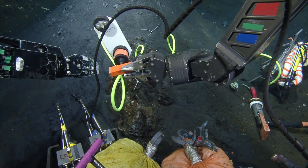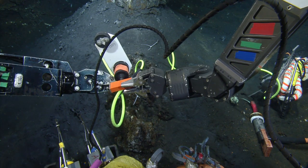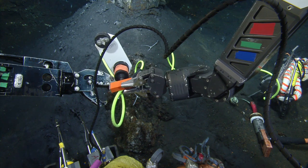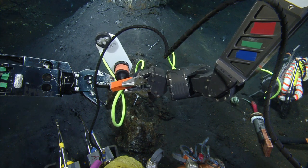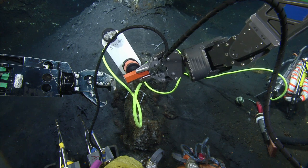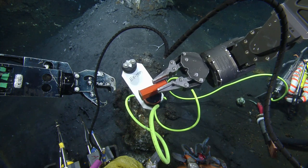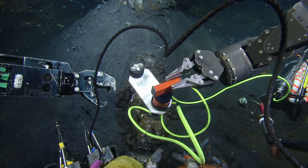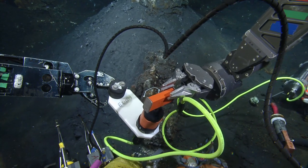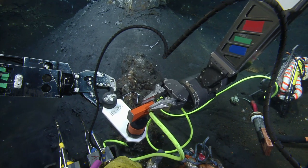Rennie, do you mean there's an offset between the vehicles and the actual vent, or an offset of the vehicles just from USBL? At depth, our USBL positions have been offset from the existing positions. If I'm over an IP, it shows me as about 20 meters south. If I'm over the bars, I'm about 20 meters south. Right, but are we confident that your positions aren't the correct ones and the old ones weren't offset? No, I'm not confident in that, mainly because this is an AUV map, and they also use USBL to get their positions. So the map, the positions, and us all have three different ways of getting subsea position.